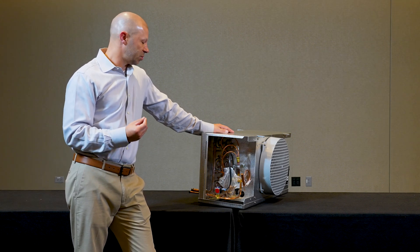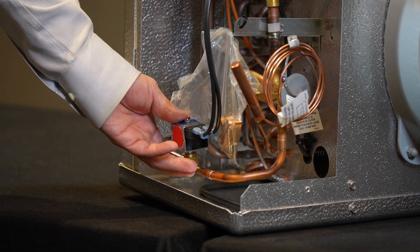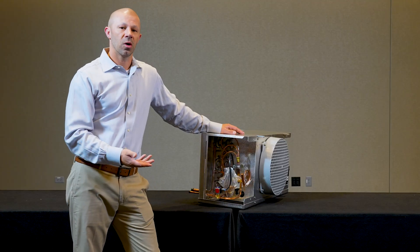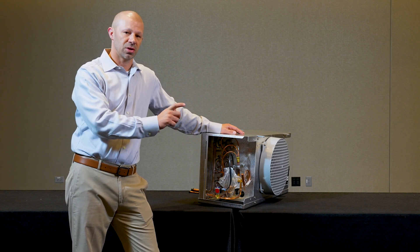The purpose of the valve, like I said, is to pump the system down. When the thermostat satisfies, it de-energizes the coil, shuts the valve, and allows mass flow to cease through the coil, going to lower and lower pressures on the low side of the system, where your low pressure cutout on the condensing unit turns off your compressor.